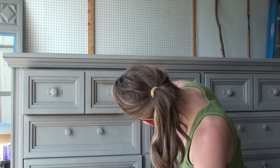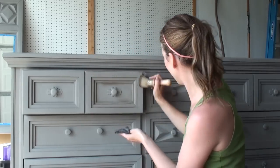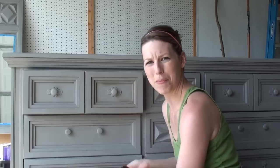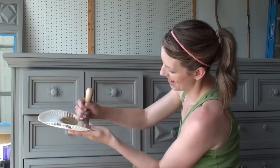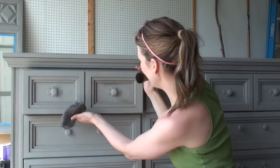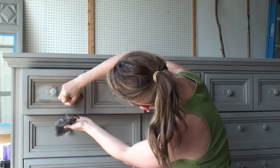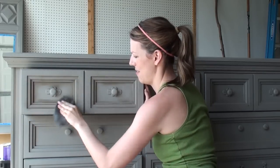I'm going to do my hardware a little bit too, and these outside edges. I'm going to get a little bit more wax. I'm rubbing it in — I take most of it off. I'm very light-handed with this because it can get muddy really quickly if you're not careful. Just make sure you're rubbing it in really well, then go right over it while it's still wet with my steel wool.